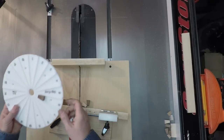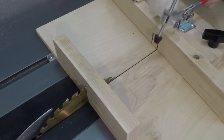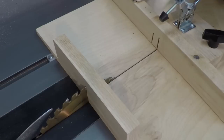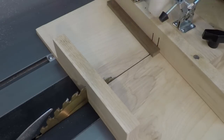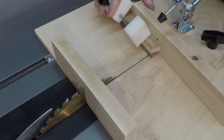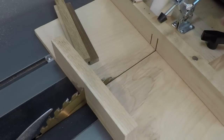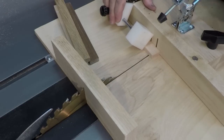That all works fine and you'll have no problems with it. As you can see, going three at a time you can go fairly quickly. One thing I don't like about these sleds is the clamp — if you go from one piece to two pieces to three pieces, you always have to adjust it, and if it's not perfect it doesn't do much good. But what I was realizing is that if you're using this flip stop, just by holding it down in that position you can clamp one piece, a second piece, no problem, third piece. And even if you have some short stock you still have all the control — pretty much as much holding power as any clamping situation — but your hands are still three inches away from the blade.